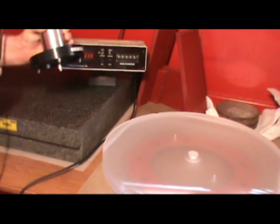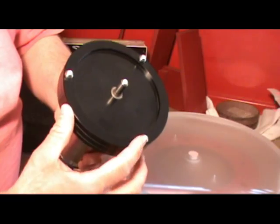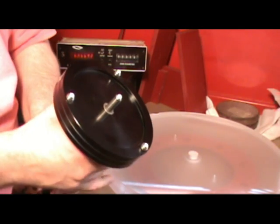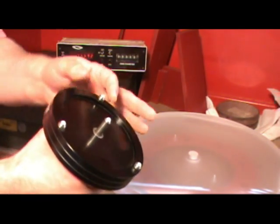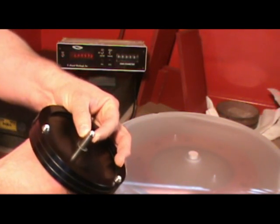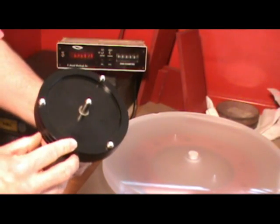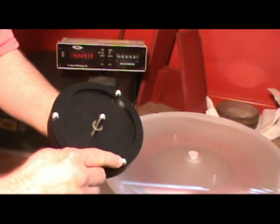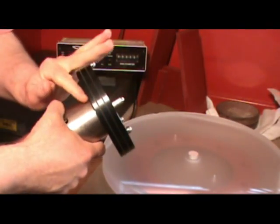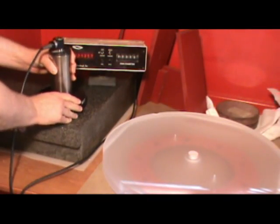Now this unit is the actual measuring head on my spherometer. You can see it has a standard three-ball spherometer plate — three balls that define the points where it touches the mirror. And then there's a central probe that actually measures the depth of curve on the mirror. If you look at the display on the back here as I move this up and down, the display on the spherometer changes, and that's how it makes measurements on your mirror. This particular head is a five-inch plate — five inches in diameter, or two and a half inches from each leg into the center. But on my spherometer, this central plate can unscrew and come off, and I can replace it with different probe plates to do different kinds of tasks.